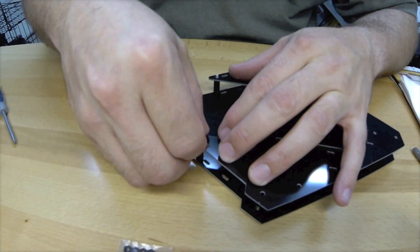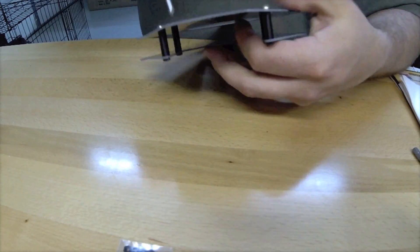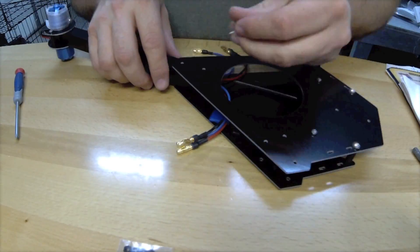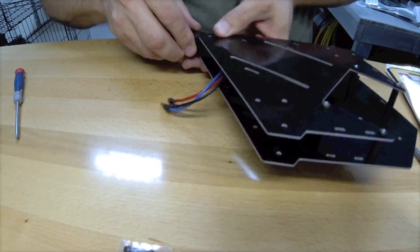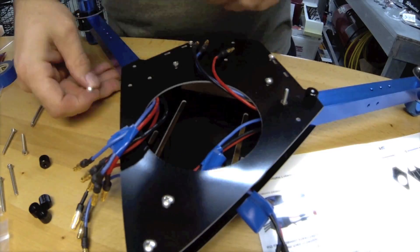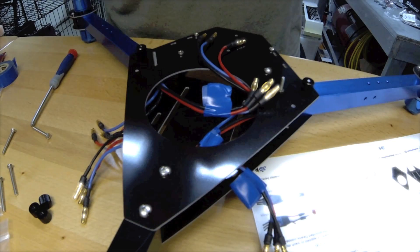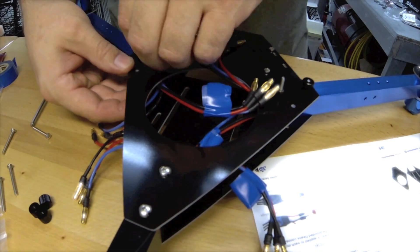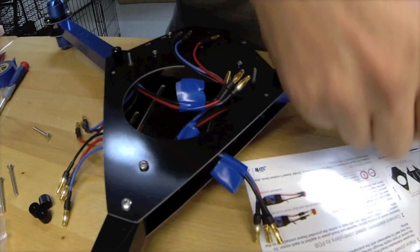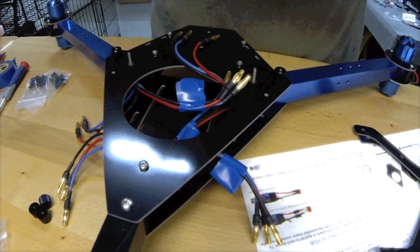Now here on the frame, pretty straightforward — follow the directions. Put the spacers where they go. You do want to take note of the top and bottom plate, as there are some different slots and there is a correct orientation to those, so make sure you do that correctly. The other thing is the bolts that hold the arms on. The inner bolts will actually be facing upwards because that's where your top deck is going to mount. You'll see in that picture my black rear arm — the bolts are actually facing down. I ended up having to fix that later, but make sure those inner bolts are face up, and they're longer because your top deck is going to sit on top of those bolts.